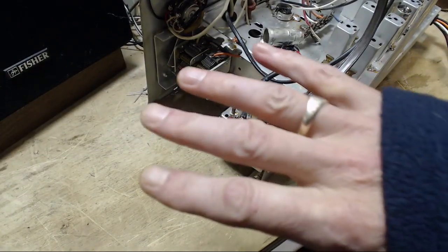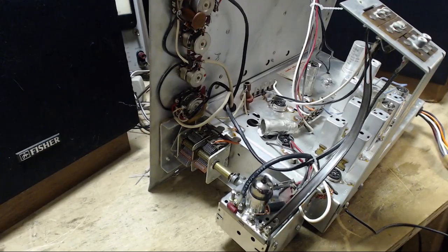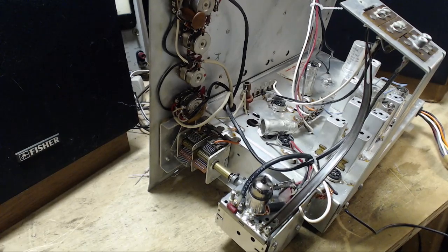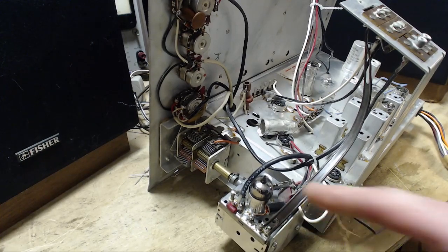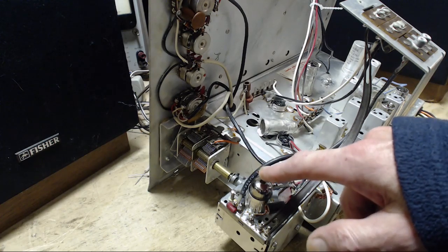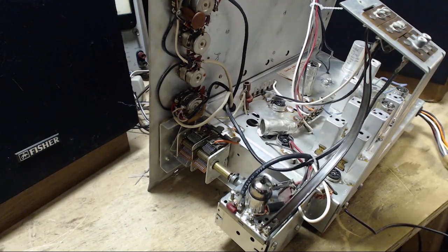This whole receiver and amplifier are among the last sort of tube equipment to come out onto the market. And they contain some of the last tubes that were manufactured. Some of those last tubes, I cannot find the directions to test them on my tube testers. So either I don't have a copy of an update, or there never was an update issued for some of these tubes. So I've hunted around ferociously to find out how to test this tube, 6C9. Turns out one of my other testers, my Precise 111, will test this guy. So he hasn't been tested yet. I bet you he's dead too. Why not? That would be the odds.